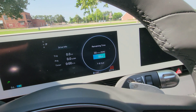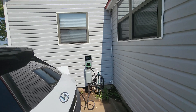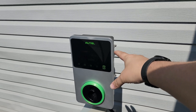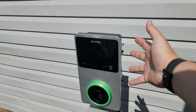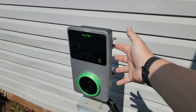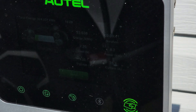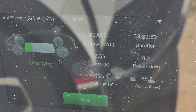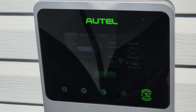It's back to charging. This charger has got to be able to charge cars in 75-degree temperatures — that's just ridiculous. Keep in mind, this is the commercial version meant to be used at 50 amps in commercial situations, in a parking lot in direct sunlight at 50 amps. I already had it reduced to 40 amps and it's still overheating, so now we've reduced it to 35 amps. We're going to see if it can carry on at 35 amps or if it's going to overheat again.